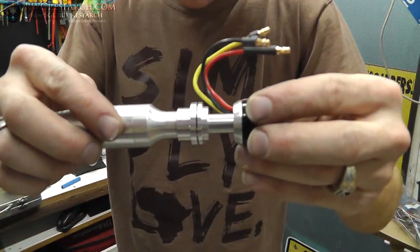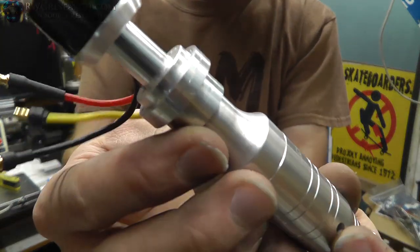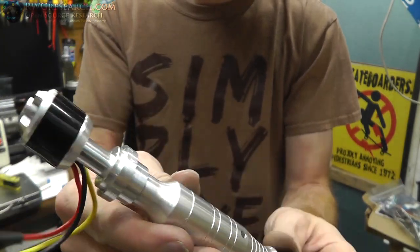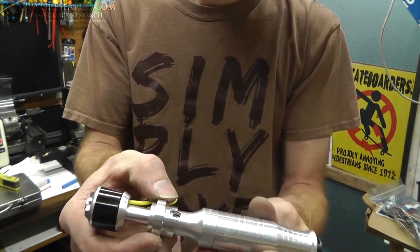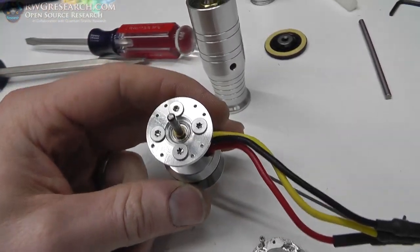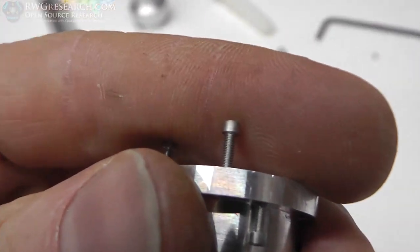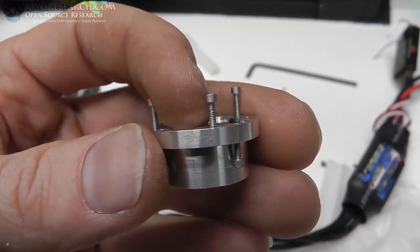Look at that — it's not done, it's just sitting there, but that looks really good. I am happy with the way this turned out so far. I did forget to put a few set screws in this guy though — I didn't forget, I'm just freaking tired. Man that looks good. Almost there. So there it is — I finished the tapping of the holes. Those are tiny screws — those are 0-80. The holes I drilled for pre-holes were 1.25 millimeters. That's how small those screws are — they're tiny.